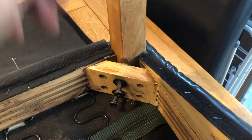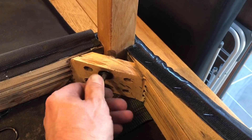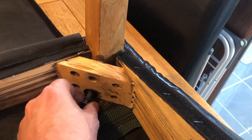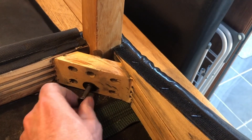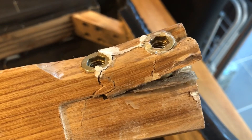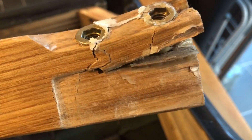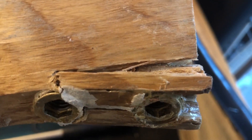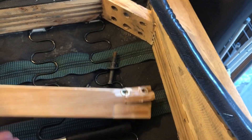About four chairs in and I came to this chair with an incredibly loose leg. I've pretty much loosened this but they were incredibly loose — you can see that's moving up and down with every rotation. I'm going to totally remove this and have a look at the damage. It looks like I've previously repaired this with wood glue; in fairness the glue has held, but it's found another place to give up, which is disappointing. We're going to have to reglue that and hope for the best.